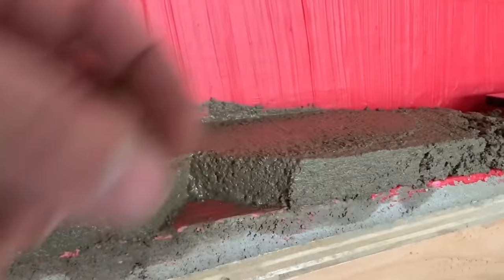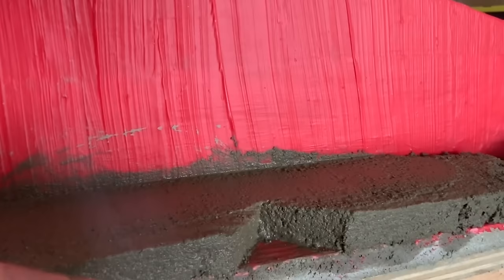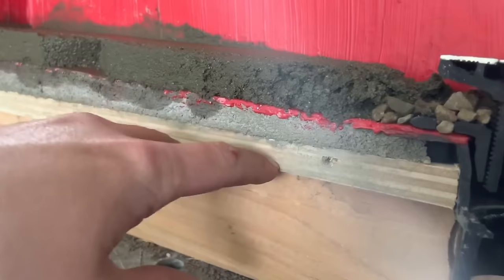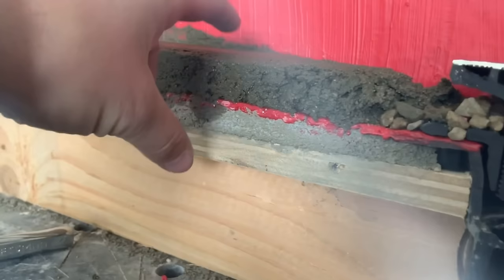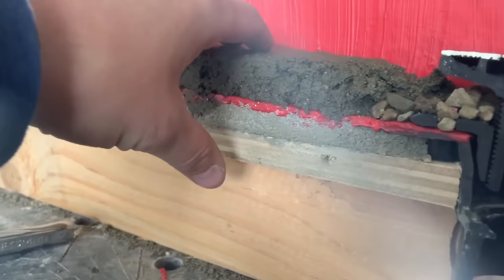As you can see, we're about one inch thick all the way through. You could reinforce this with a chicken wire lath to strengthen it. I personally don't think it needs anything — it's a case by case deal. There are times that I do it and times that I don't. If you do it every single time, great. I just personally wouldn't do it every time, especially if I'm the one who from the ground up built the thing and I know there's very little or no deflection on the substrate. If it does crack a little bit, deck mud itself is an uncoupling membrane, so minor cracking shouldn't transfer through to the tile and grout.